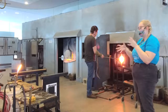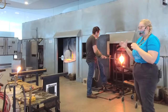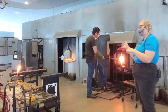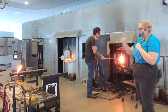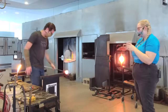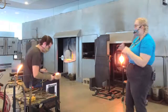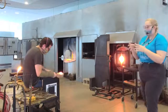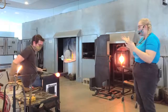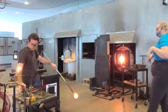Fruit wood's really special because it has that really tight grain pattern, which means there's not a lot of sap in the wood. So we can leave it on the glass for a long time before it eventually catches fire. We have a couple of wooden tools that are dry, but most of them sit in water so they actually become waterlogged. The wood never really makes direct contact with the glass — it actually creates a steam barrier. It's the same effect as when you have a really hot pan and throw water on it and the water dances. That's called the Leidenfrost effect.